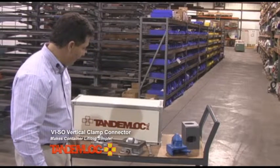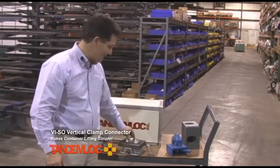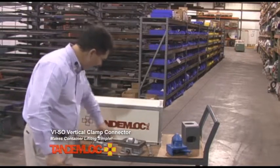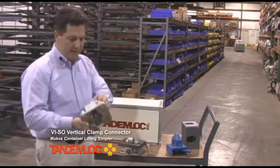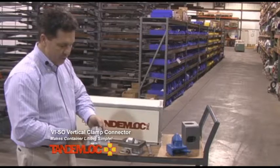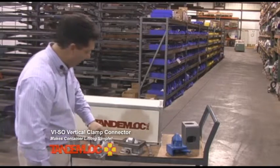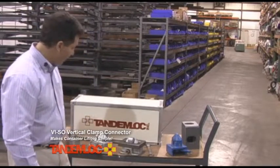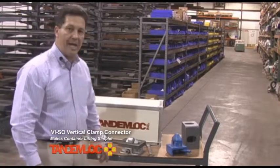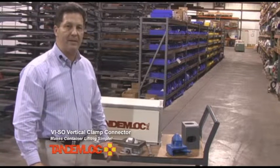The capacity on these is about 44,000 pounds in upward restraint. They are galvanized. These show as bolt-on units. If you prep the galvanized, grind it off, they are weldable. The steel is low carbon steel. You can weld it, and it's a very good product. So we do keep a good inventory of these items on the shelf for immediate shipment.